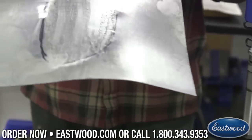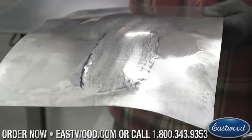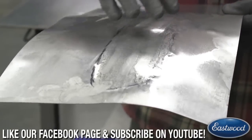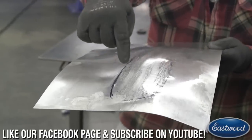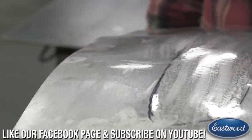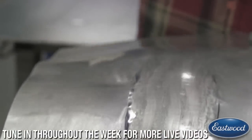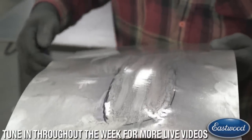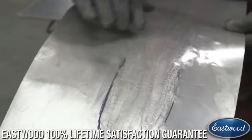So you can see that spot. The other nice thing about spraying the lubricant on is it actually highlights the panel, so it really makes any spots that are extremely low or high show up really quick. So that's why we were able to see those lines, right? Those two lines that were in there. And all I did was, I turned the panel long ways, and I was able to just simply go back and forth over it. And got a fairly good surface there.